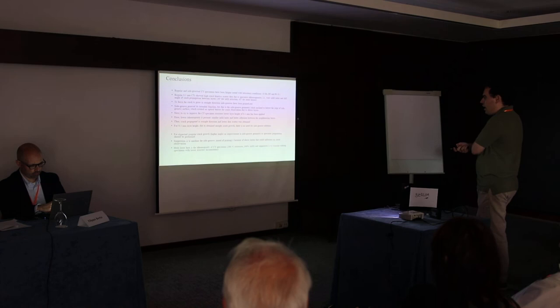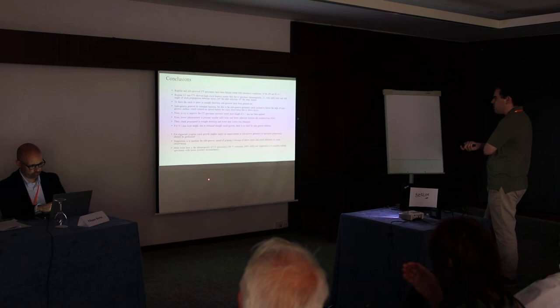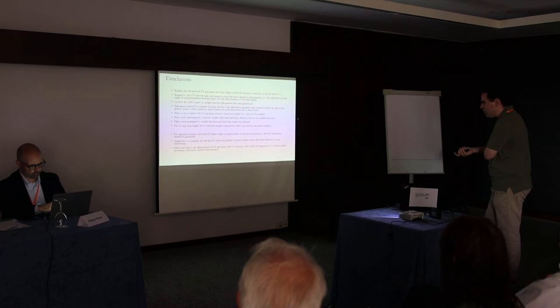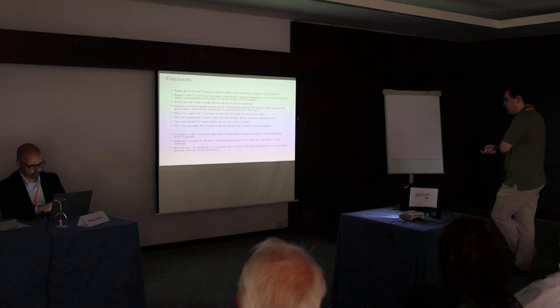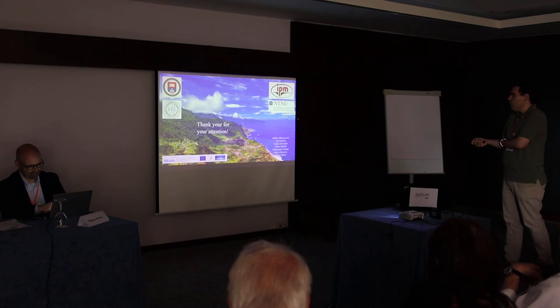And the main issue here is the inhomogeneity of CT specimens, because they were printed with FDM technology, and of course this technology has some issues. Just to point out that the specimens were printed at 200 degrees Celsius extrusion temperature. All were printed with 100% infill. And the suggestion is to consider improving the specimens and creating them with lower structure inconsistency. Thank you for your attention.